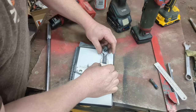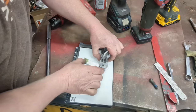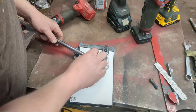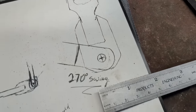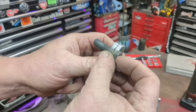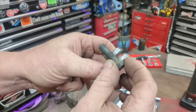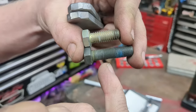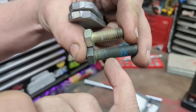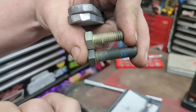The pieces are basically cut out. This part will go right here with a pivot hole, and we'll have one of these sandwiched on each side with their own pivot holes. I'm going to use a 3/8 fine-thread bolt through there — I'll thread the material so I can just thread it in and sandwich it that way. Quick fact: a fine thread is stronger than a coarse thread not because there are more threads to grab onto, but because the bolt is actually bigger — those grooves don't cut as deep, only half as deep as a coarse thread.